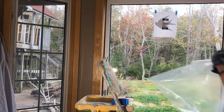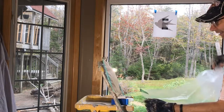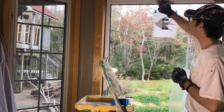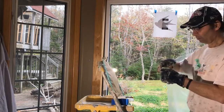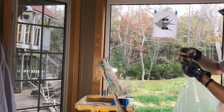If I were masking for painting, I wouldn't be masking. I don't mask unless I absolutely have to. With a good brush — a Purdy, P-U-R-D-Y brush — if I were painting this frame against this window and didn't want to get paint on the glass, the Purdy makes such a straight line that I don't really worry.